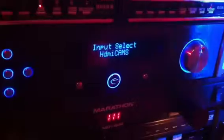Our next input are the HDMI camera inputs. So on the side of the case here, we have 4 HDMI inputs. Now these are connected through our Cat5 extender connection, so you can have your cameras from long distances away. And those are sent to a 4x2 HDMI matrix switcher in front here. And this switcher allows you to have 4 cameras sent to 2 outputs in any combination. Output 1 is the channel that goes through the receiver here, and the second output goes directly to channel 4 on our projector matrix switcher.